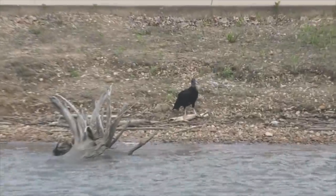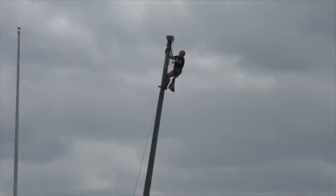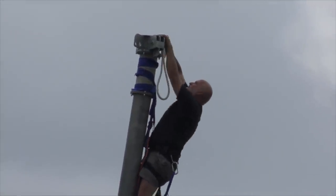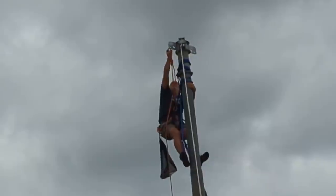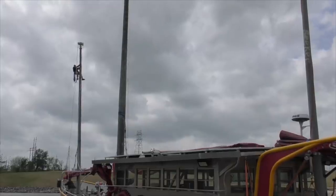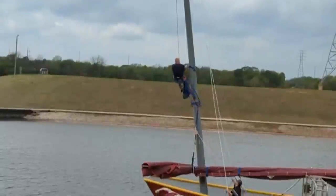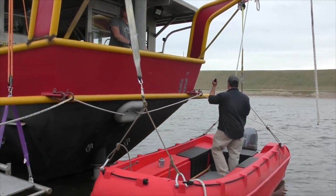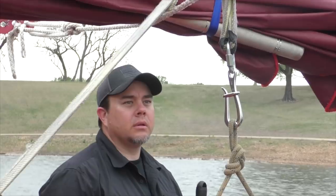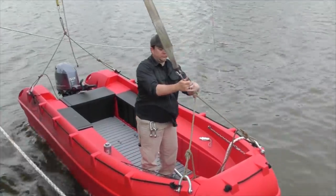It was insanely windy out today, but I had Alex and Dustin here as crew down on the boat. This job really requires somebody down there to tie things on and hoist things up to you, but we got the forward masthead all assembled — it was a nice thing to get done. I just love this activity because there's that little bit of fear you feel while you're up there, and I think we all need a little more of that in our lives. Dustin got back there working on the new bridle for the boat and we put some Pelican hooks in — these things are marvelous. For a rapid launch and recovery, Pelican hooks lead the way: you can squeeze them and while you have load they stay hooked, but you take that load off and they open up quickly and they're very quick to put back on and cinch back up.